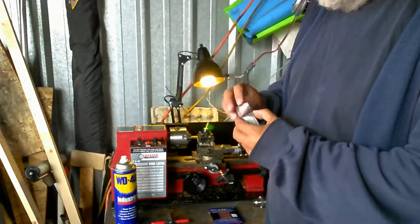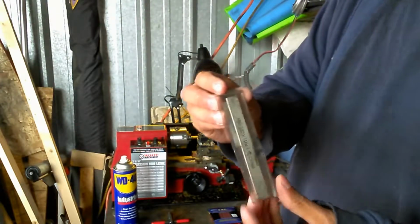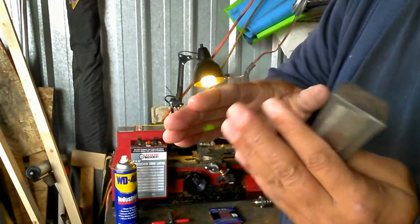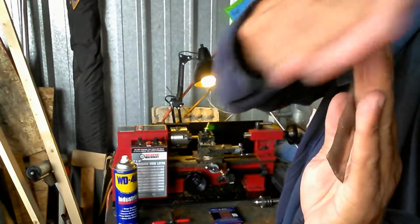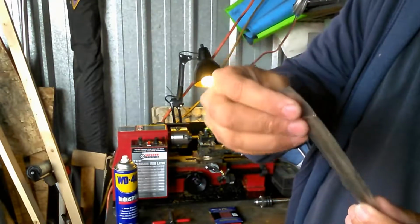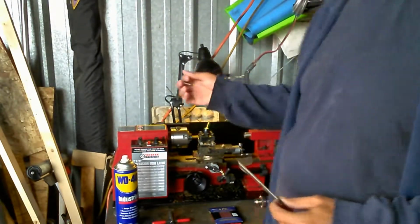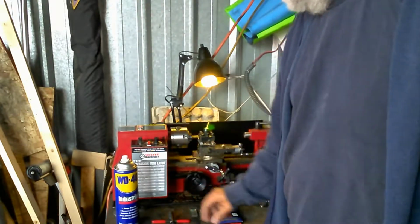I can't seem to get this out of here. Anyhow, okay, you can see the piece in here, okay? So it's got a cutoff piece on the edge here. Now this piece is slightly beveled, so the end is going to be slightly like this. That indicates how you actually put this piece into the cutoff, to be able to cut off the piece that you're doing and where you're actually going to start that cut. And you'll get used to using the tools as you use the lathe.